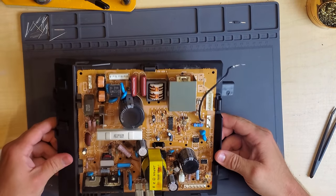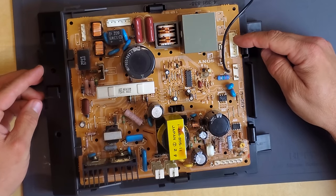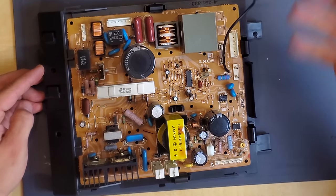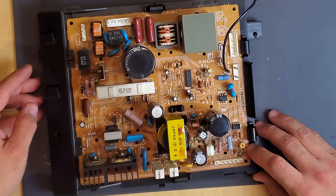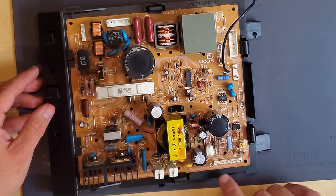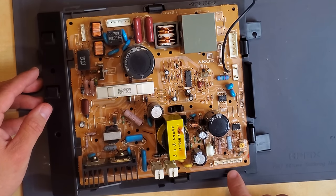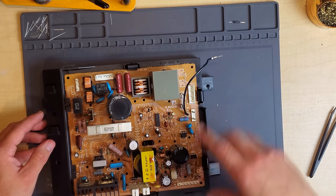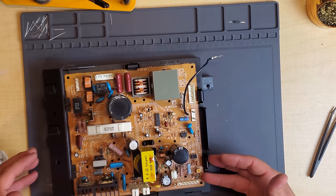But before we reinstall it and test it, I'll tell you about the other points on this board. We went over this connection point, which is our ACN, and this is a ground which is looped through the rest of the monitor. There's a 115 volt adjustment potentiometer - there's probably no reason you should really mess with that. What we've got here is a test point for if you need to run some kind of scope test - there's probably one listed in the manual. And then this is our main power out. This one's running off a little bit different voltages than others - it's got a 7 volt pin, a 15 volt pin, and a 115 volt pin. And that's the main power that's been converted by this power supply and goes to the rest of the monitor and powers everything up.